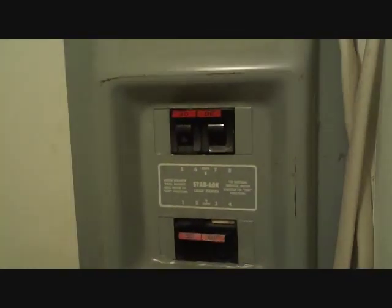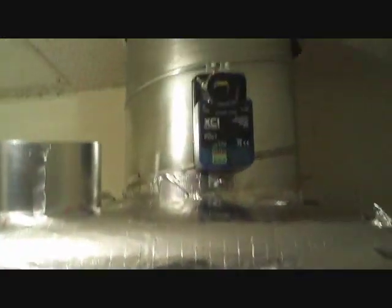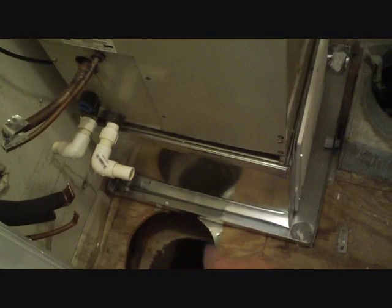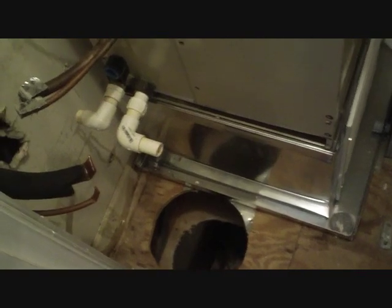We're going to add a thin piece of ductwork running right across here, with another duct coming off the bottom and the bypass duct coming off the bottom as well. We've got our new ductwork on top of the unit — a lateral piece with all we could fit in there. We have two zone dampers going up and down. We'll connect the one down here to the supply plenum for the first floor, and the bypass duct will come off here, go down and run around into the return. Those two will meet together, and after that most of the ductwork will be done except for the stuff down in the garage.